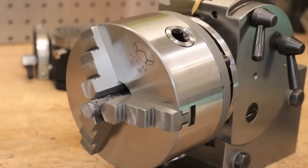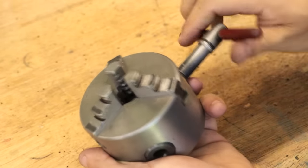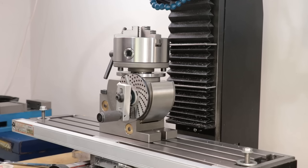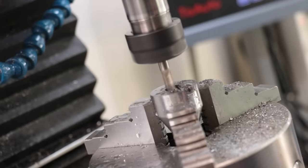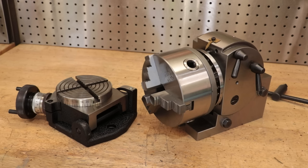For one, a big disadvantage of the dividing head that I have run into is the fact that it is physically larger, and I've run into a lot of clearance issues with the spindle and my tooling running into the chuck. The rotary table, however, should be able to fit my smaller chucks and I should hopefully be able to avoid some of those clearance issues. Secondly, it's not really set up to cut with the chuck facing upwards, and in the few times that I've had to cut with the chuck facing vertically, there was almost no room for the part and the tooling once I'd gotten it all set up. The rotary table by contrast is effectively half the height of the dividing head, and even with a chuck installed it isn't going to be as tall as the dividing head. So with this setup I can now index parts that are laying flat. And finally, I should be able to use the rotary table to cut radius curves, and that is something the dividing head really struggles with.